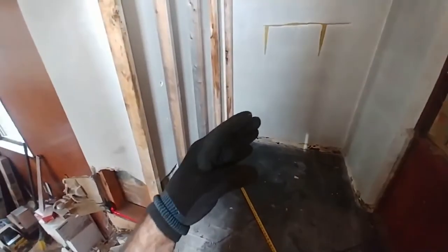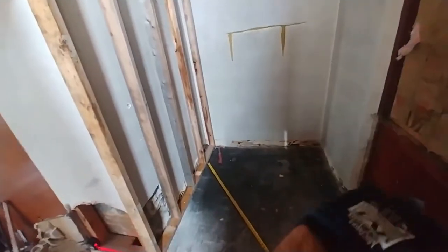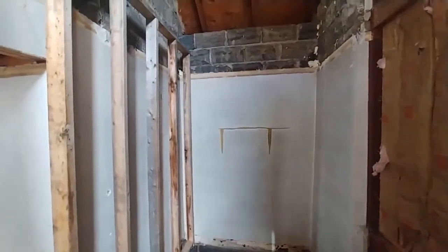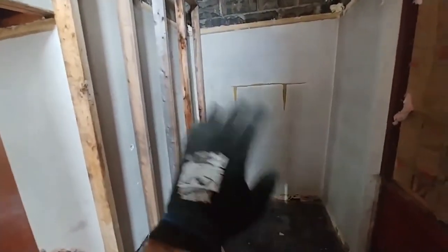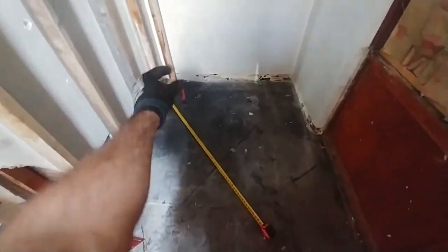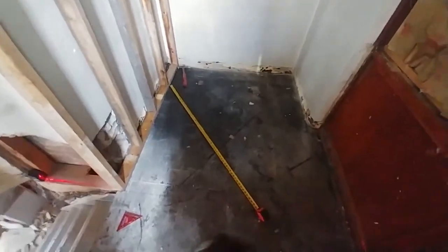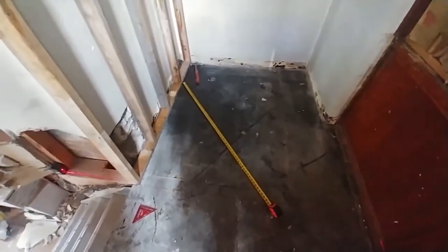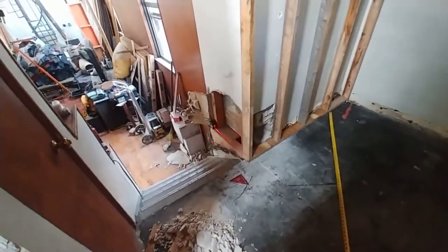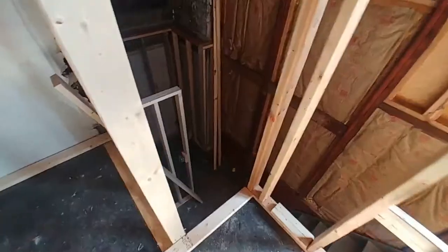If you just built wall sections and slapped them tight to the walls all around in here, you'd have awkward angles and more time spent putting the drywall in here. And like I said, as you move equipment and shelving and counters and anything else like that in here, it starts to betray the fact that the room isn't square. And if you have a square floor covering system where it dies into the wall, it shows all those little pieces that are weird shapes, and it just looks bad. So this ought to look real nice, and we'll hide all this garbagey old building behind it there.